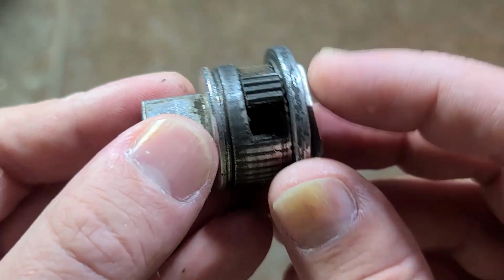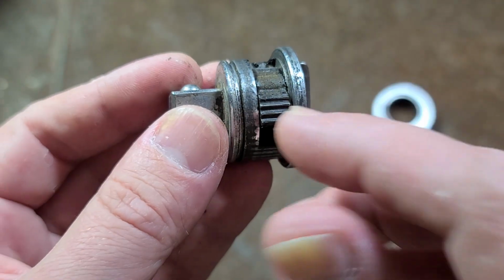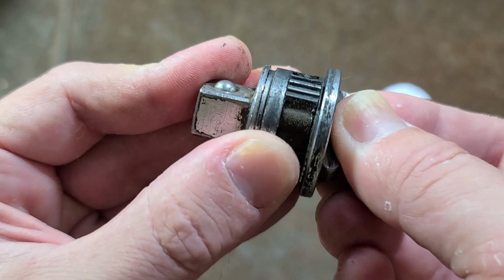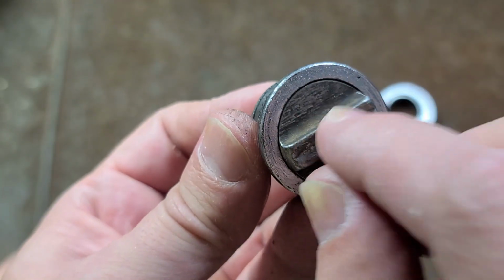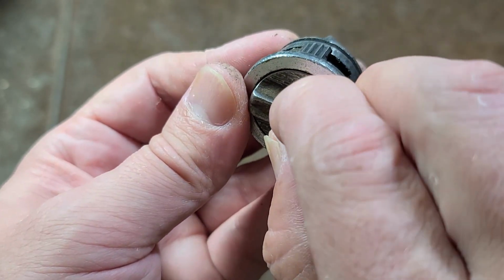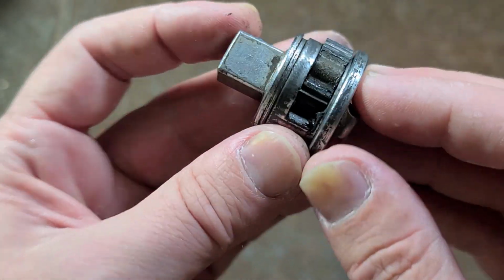One thing I've since learned from taking apart a broken Napa roundhead ratchet that had twin pawls is the real second reason for 2 pawls isn't just more traction to prevent slipping, but that these pawls are rocking back and forth on a little pin. To rebuild these, really you have to get in there with a little screwdriver, push down the detent, and then try to work the reverse lever out.